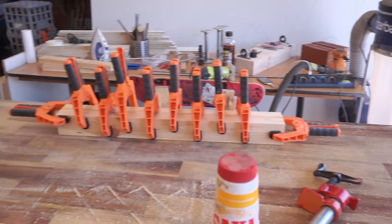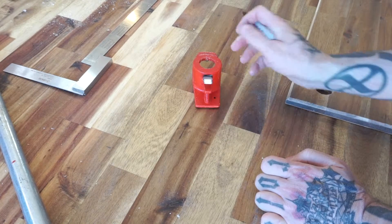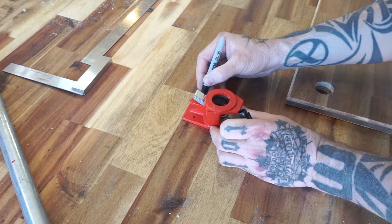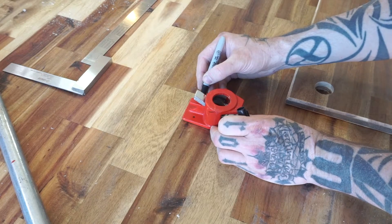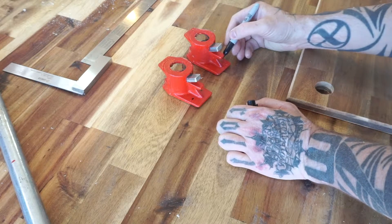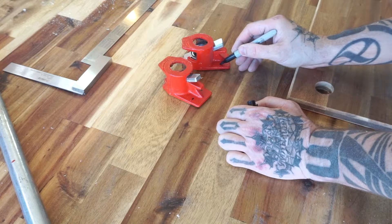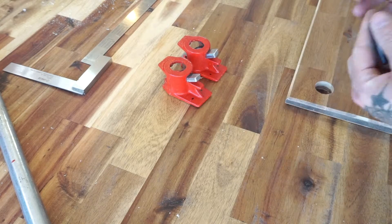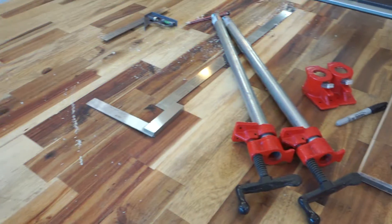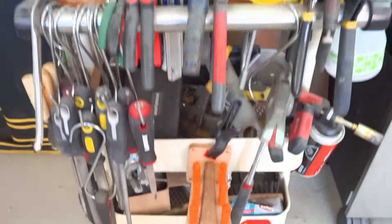This next part is optional for the front jaws, but necessary for the back ones, which are what I'm marking here. I'm drawing positions for screw holes with plenty of room for the heads of the screws. These back jaws get screwed into the inside of the cabinet, so when you remove the pipe clamps to put the vice away, they remain in place, ready to receive the clamps again. I ended up doing the front ones too, but I actually prefer to leave them unsecured, as it gives me a bit more scope for adjustment.